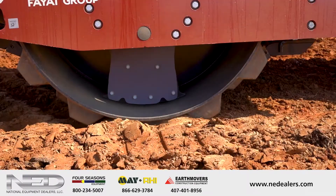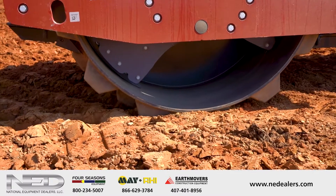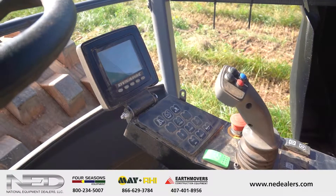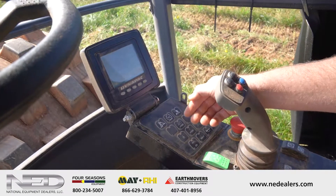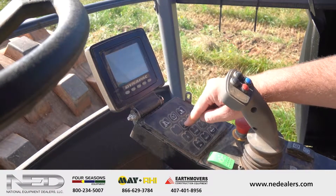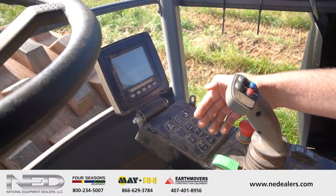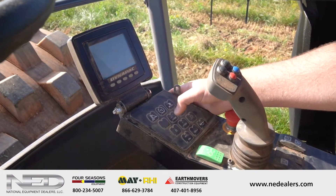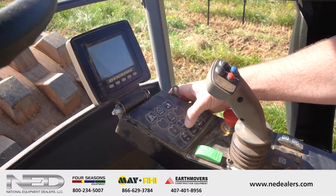The next button — you're going to have to press that and turn the vibration on. Anything on the machine past turning it on, you're going to have to use that button. The next button right here, you really don't need to know much about besides this is for your manual frequency control. So if you have manual frequency control on, your seismic is not going to be on because your seismic automatically controls your frequency. If you did want to control it manually, you would turn that on and then plus or minus for your frequency.